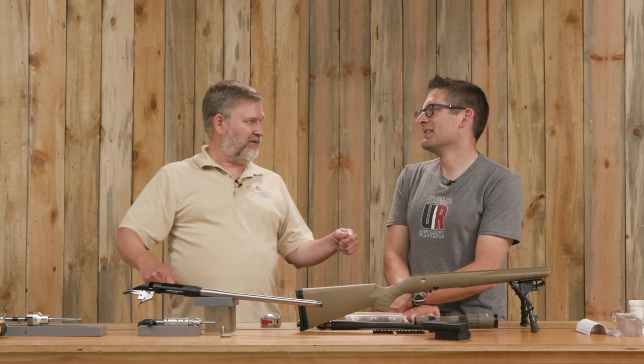It's 16 1/4. I don't like to ever do them right down to the minimum. Sure. When I was in school, Dunlap's thing was do the country sheriff's rule. And the country sheriff's rule is actually 16 inches showing. Because the idea is the country sheriff is just going to grab his tape measure and he's going to look at what he can see. You don't want to explain common barrel datum points to him on the side of the road. Yeah, it's kind of hard to explain. Look, the ATF does it this way.